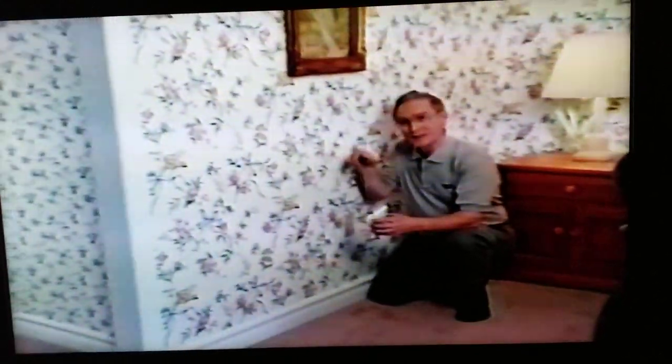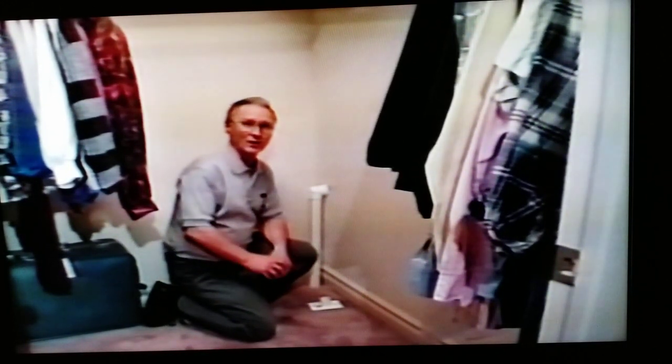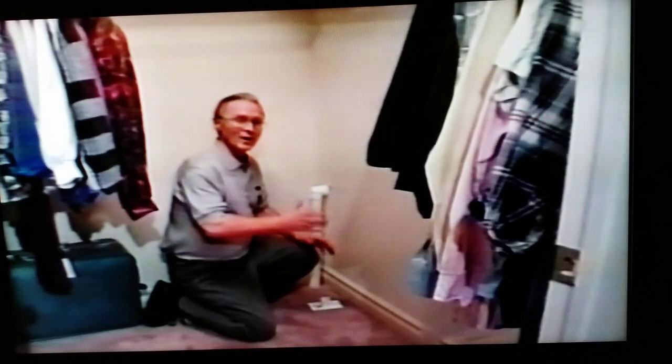Sometimes it's easier on a main floor installation to install the inlet valve on the outside of the wall of a closet, running the pipe from the inlet valve through the wall to the inside of the closet and then down through the floor. Upper level inlets can be installed in the same manner, running the pipe through the floor of the upper closet and through the ceiling of the main floor closet. Be aware that the vacuum pipe will be exposed, so in each closet, try and keep it in the back corner if possible. When using the closet walls for the location of the inlet valves, use a piece of cut coat hanger to drill a pilot hole through the exterior and interior walls — keep the coat hanger level so the holes will be in line.